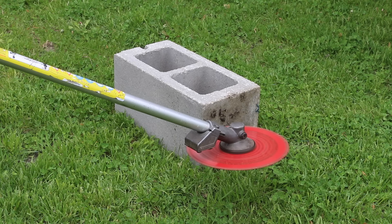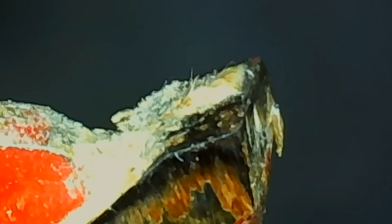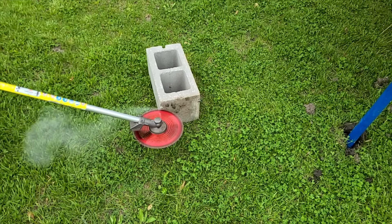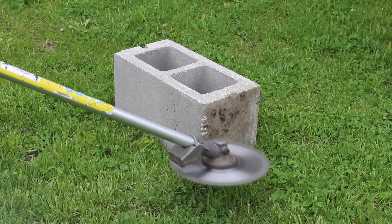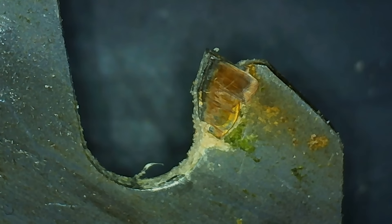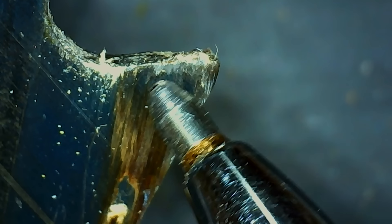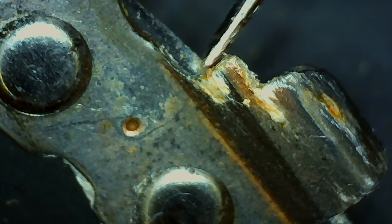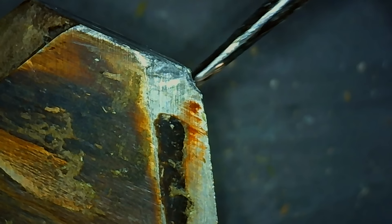There's always a good chance a brush blade will experience incidental contact with rock or concrete, so let's see how much damage comes from contact with a concrete block. The Kurtzall held up really well, with the concrete causing only additional wear to many of the carbide teeth. The Renegade experienced chipping to several more teeth, but not nearly as much damage as from the metal pipe. The Forrester 50-tooth and ATIE blade both held up well with only minor additional chipping. The Oregon experienced more visible wear to its cutters, while the Forrester chainsaw and Stihl both held up really well with only minor wear.